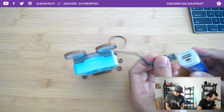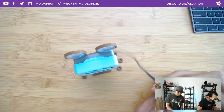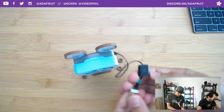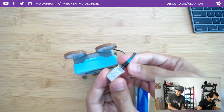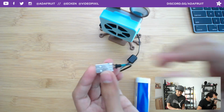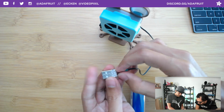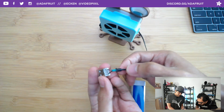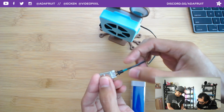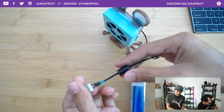And then we can start soldering once we plug it in. So that's kind of the whole project, really. Yeah, so let me see if I can pop this out still. Yeah, I can. Cool, and it makes that sound too. So this is, we call it the DIY USB connector. It's hard to get focus on it, but it's really easy to solder to this bit. You just add a little bit of solder there to tin it, and it comes with these little strain reliefs, so that when you're pulling on it, it doesn't pull out the cable. So that's nice. Little plug there, and then the shell just kind of press fits.